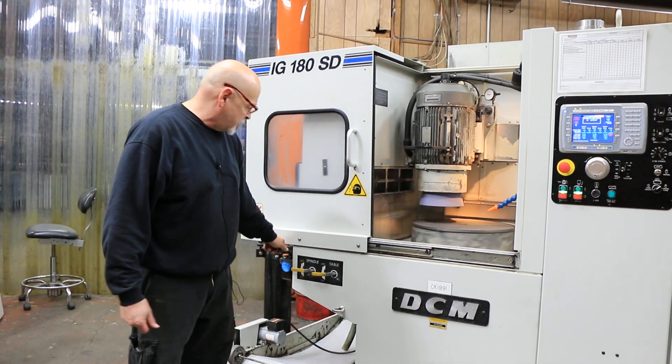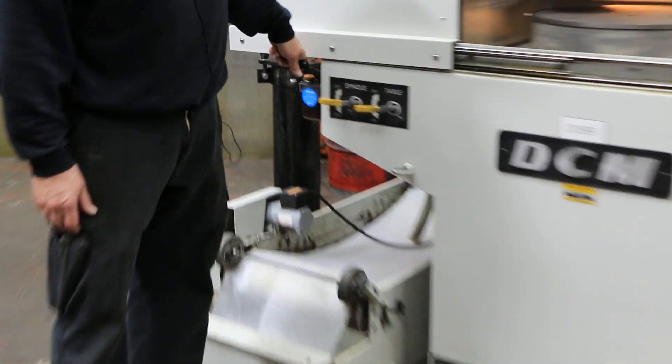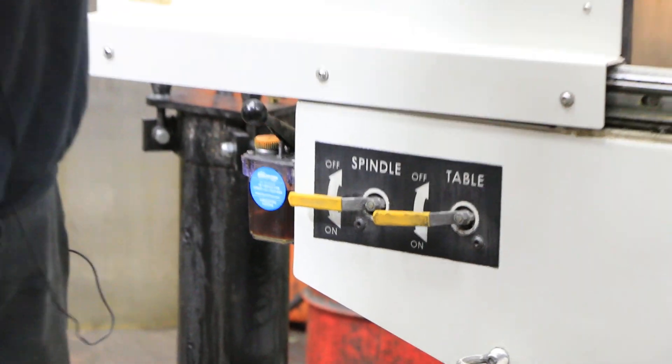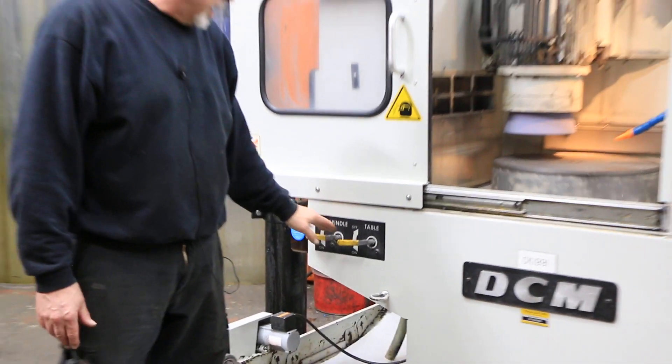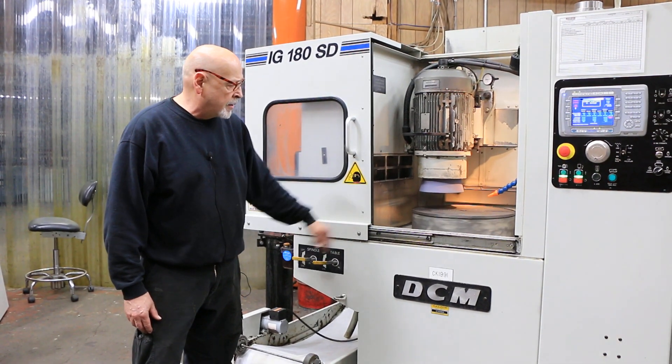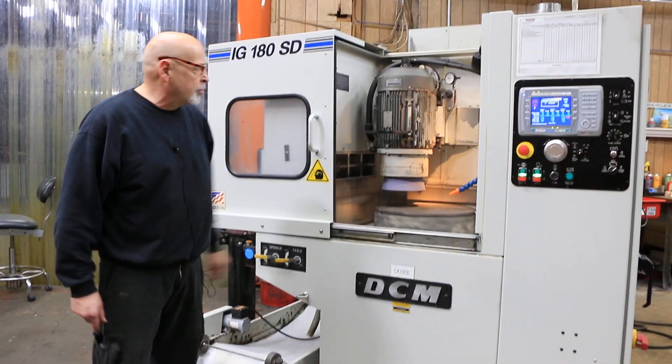There is a one-shot lubrication system for lubricating the slides on the machine — only the slide up and down and also the revolving of the chuck. You've got independent controls or valves for letting water down on your workpiece or to come through your spindle.